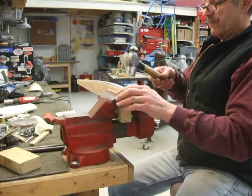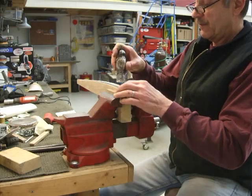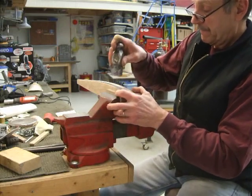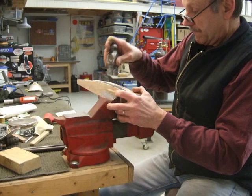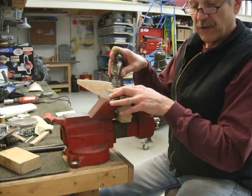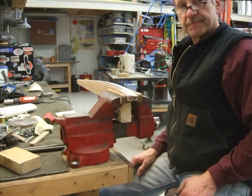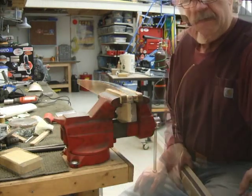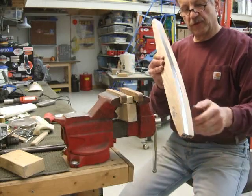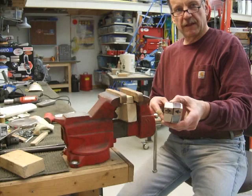It's all gone — very nice and smooth. It's basically ready. I still have to work my way down to the end of the rib and also on the backside, but that's basically how you do it with the hammer — just have good control. I don't whack it from the back because the hammer tends to wiggle. I grip it like this, using a glancing blow. That way if I don't hit it perfectly, I won't put a smiley in the rib. Here we are a number of minutes later and it's finished — planished, very nice and smooth on both sides. It does have the banana shape to it, but that's okay. That's the next step: taking that out.